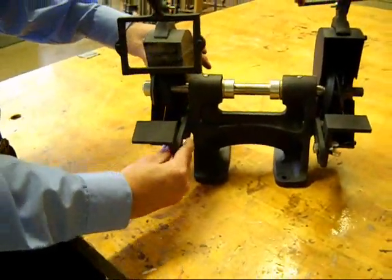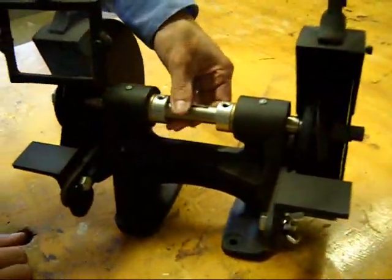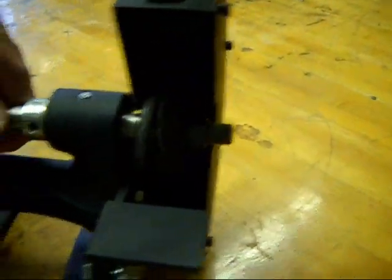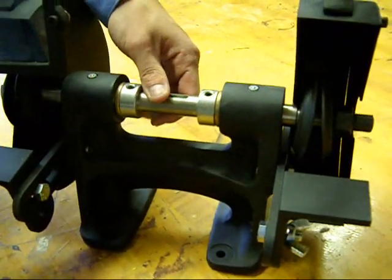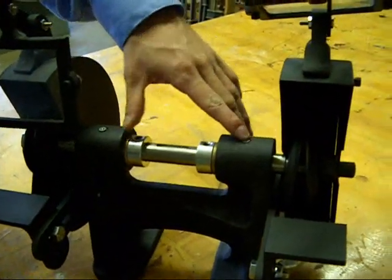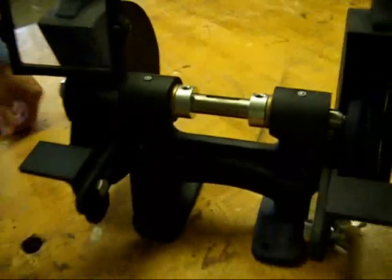The more intricate thing is your drive shaft. We got on a metal lathe and we had to put threads on the end — one side is right-handed threads and one side is left-handed threads. We then also had to put a slot in it so that way you can attach a belt. And there are bronze bushings in there with oilers on the top to keep it lubricated.